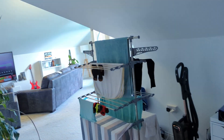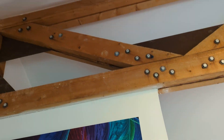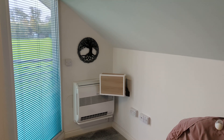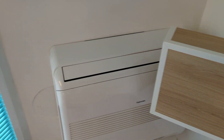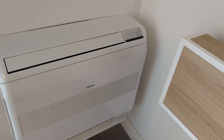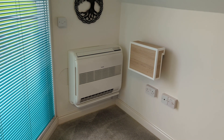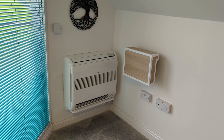What I really wanted to say is the importance of air-to-air heat pumps and their installation: do not put them high up. That is the biggest mistake. In my last house I had two Mitsubishis and they were high up. Of course you get, if you're lucky, a hot head, and you always get cold feet. There's always stratification - the unit works too hard to try and get it to the correct temperature where you are, because it's high up and the heat comes out and goes straight up and just warms the spiders and the light bulbs above your head.